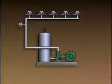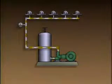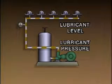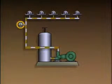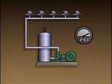This is a simplified illustration of the grease system. The cylinder contains the grease supply. The motor and pump that force grease out to the bearings are at the base of the cylinder. A single line supplies grease to several bearing housings. There are two main things to check on this type of lubricator: lubricant level and lubricant pressure. A level indicator shows how much grease is in the cylinder, and a pressure gauge is installed in the grease line. If a blockage stops grease flow, pressure will read well above normal. If the pump fails or the system runs out of grease, the gauge will read low.